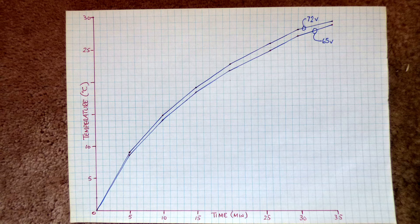If the temperatures are getting the same, that means the heat energy they consume is roughly the same, which means the output power is roughly the same at those two voltages. So there's no point in going any higher than 65 volts — 65 volts it is for me. If this proves to be a problem and the temperature looks like it's getting too high, I'll plumb in the digital gauge permanently. I may have to go for some bigger motors — the NEMA 34 is probably the next step. Anyway, I hope that was interesting and informative for you. Please subscribe and we'll see you again next time. Bye.